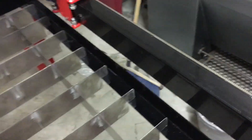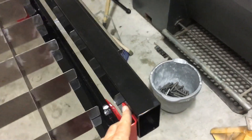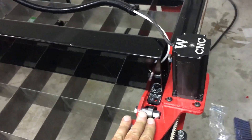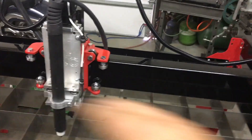The first thing to do is just put these bolts in and this rail on the two legs, then do it over on that side. Had a friend help me stand it up. Put these cross ones in and bolt these rails on. Once the rails are on, you put these motors on either side and then clamp this on. Check to make sure the thing's square with the tape measure, then roll it forward and check to make sure that these hit right here on the stop so that the gantry is square.